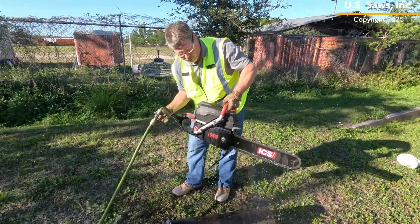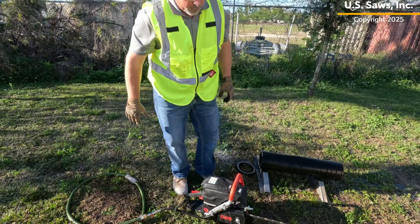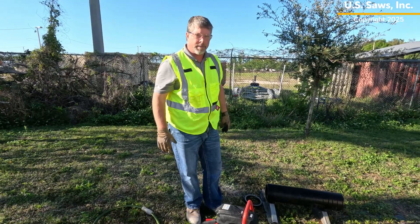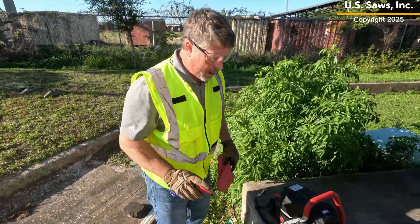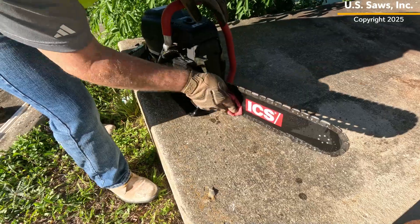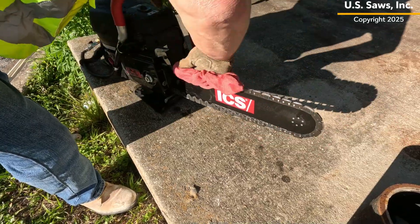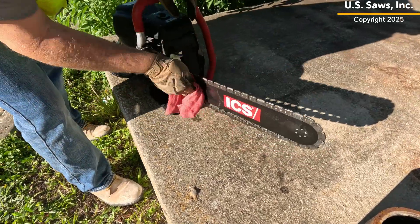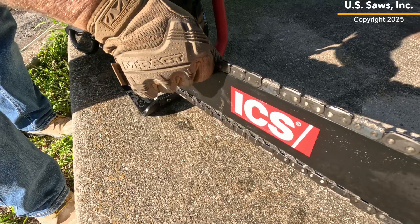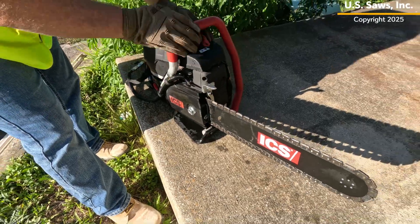After the cut, make sure that you flush out the hose and bar. Wipe the saw down with some WD-40 just to keep it looking clean and nice, and otherwise you're ready for the next cut. Ductile will leave a little residue and can rust up on the saw, so a little WD-40 on the bar and chain — make sure you work that all the way around. Pull that chain out to make sure everything's nicely lubricated. One word of caution: always wear gloves when you're moving the chain, as this is a pinch point between the chain and the bar — those are sharp edges.